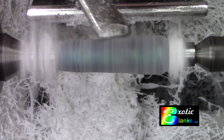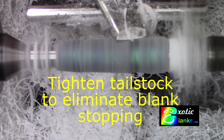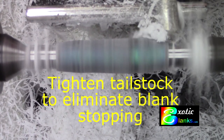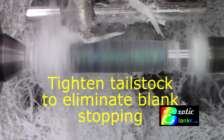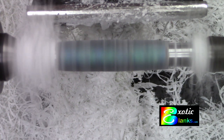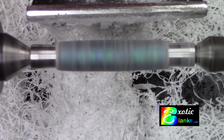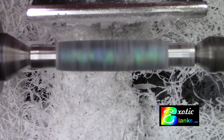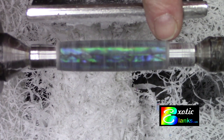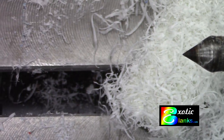Again, you can see it stop when I put too much pressure on it. Tighten the tailstock and it will turn more smoothly. Now, if you're watching this you've probably watched others of my videos, so you know this already — but when I start a pen I don't face it right away. Instead I wait until about this stage and then face it. You can see when you look at this, the blank is about a sixteenth of an inch in on both ends.